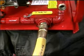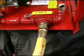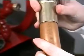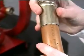The three-quarter inch by eight-foot 500 psi working pressure outlet hose should be in good condition. Check for abnormal wear, cracks, rips, tears, holes, and so forth. Monitor the hose fitting connection areas for stress separations.